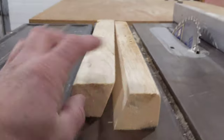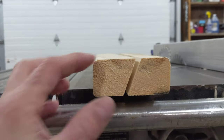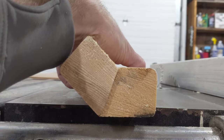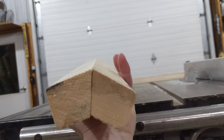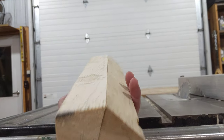If you've done it right, you'll have 2 inches left over on the bottom of the one you ripped through, and you'll have 2 inches left over on the top of the outside piece that you cut off. Then you just flip it over, put them together, and run some screws in there. Or if you're going to build it in your shop and take it out to the field with you, you can attach your plywood to each side and then end up screwing the corners together at a later time.